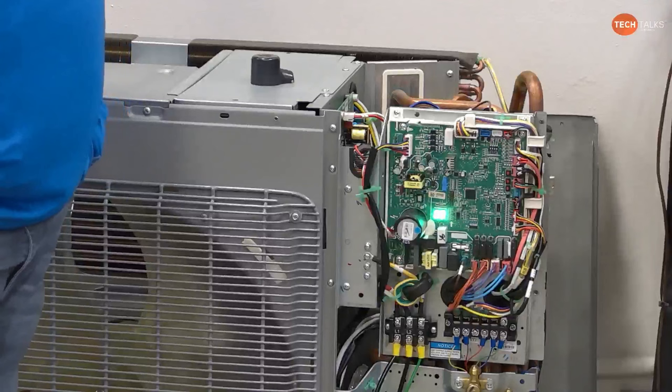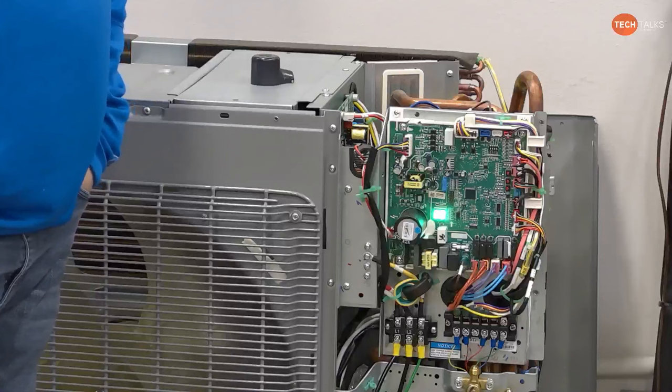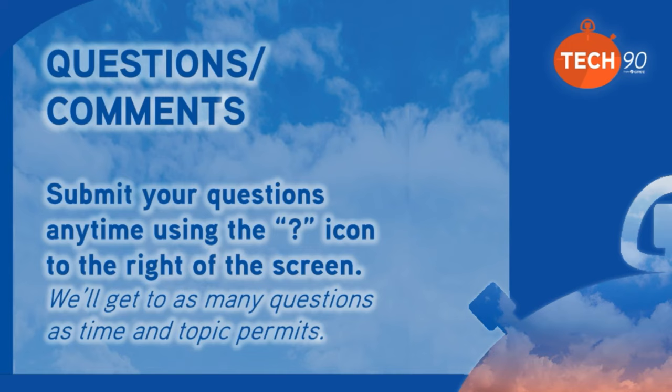Also good points, Greg. One other thing, because we get this question: what if we don't have enough wires? We installed the flex, but we really only want it to run as an air conditioner. You can do that. All you need is Y and C. It runs in cool mode, because you have to energize the reversing valve in heat mode for it to run in heating. If you don't care about defrost, all you need is Y, C, and B, and it'll run in heat pump heating mode.